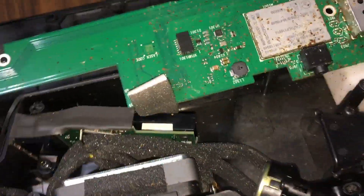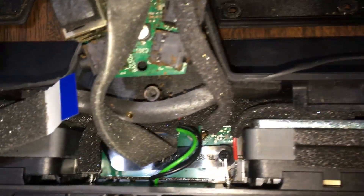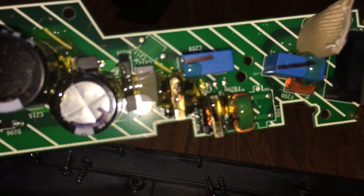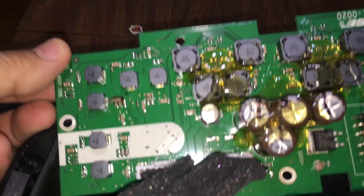There's a tunnel for the audio back pressure, and here must be the HDMI input. Those rectangular speakers — I think those are the woofers. This section, because it has some coils, must be the amplifier output, and the other part has to be the power supply. It's a switched-mode power supply. Here you have the AC input — yes, this is the power supply. And this part must be the amplifier because it has coils. Those coils are used in digital or Class D amplifiers.